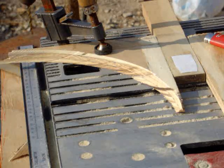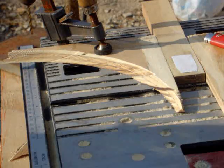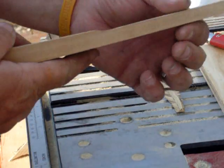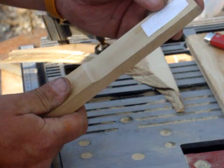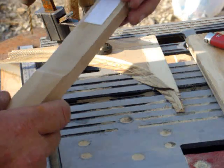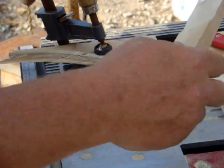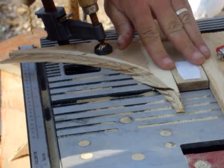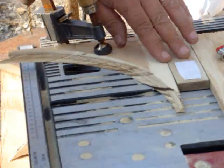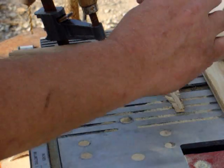So I've had it with this one — see you later. What I do have right over here is another piece of poplar wood. I planed it down to 15/32 of an inch, which is basically the thickness of plywood — they take off pretty much a sixteenth of an inch on plywood, so half-inch plywood is 15/32. I got it down nice and level using my belt sander with these clamped here. I lay it down and I can feel the edges and where I'm close and where I'm not.